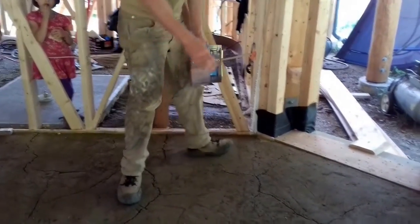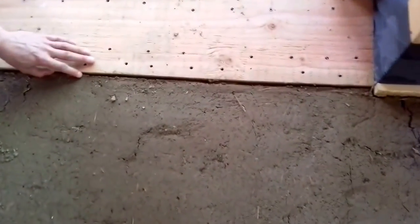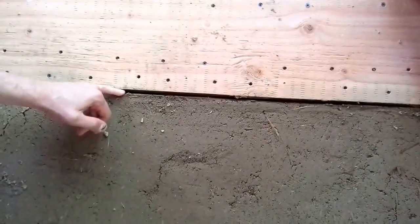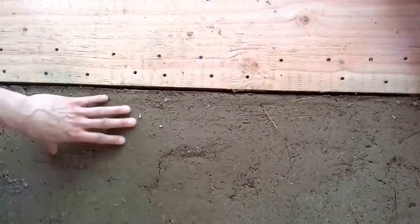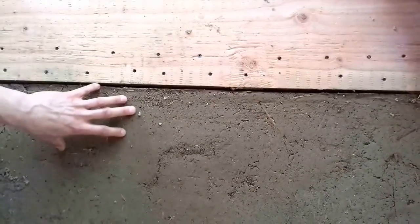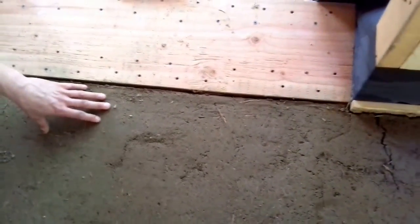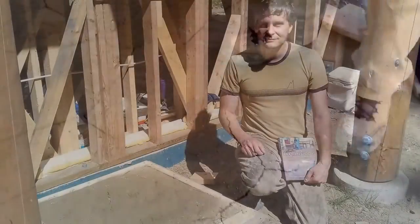If you come over here you can especially see the shrinkage away from this piece of wood at the door jamb. This shrinkage has happened only in the last two weeks, and the floor is nowhere near being dry, so we're going to see substantially more shrinkage. Had the sand content been substantially higher and had we added more fiber, we'd have a lot less shrinkage. We'll take you outside again and show you our new test patches and where we're going to go from here, after having learned the hard way by putting down an enormous amount of material.